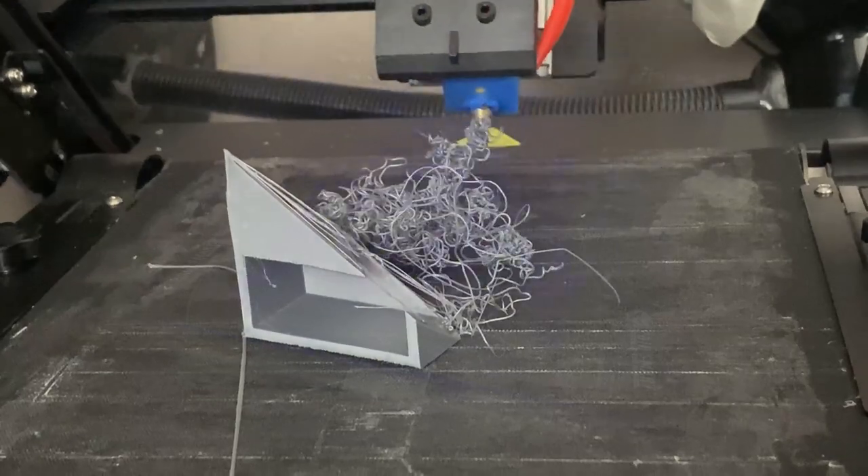Getting on to the actual prints themselves, I can tell you that with a 1mm nozzle, I of course did the proper thing and dove head first into .8mm layer heights. That's right, the deep end first. And here it is — that's not right. So I filtered around a bit more and I got this. Yeah, I know it's a bit of a work of art to some, but I was looking for bigger prints, faster and stronger than before. So with some trial and error, I found that my first problem is low adhesion to the belt. Some good old purple glue helps solve all that and gives us, well, this.